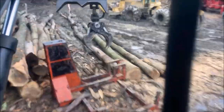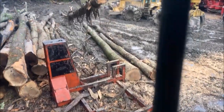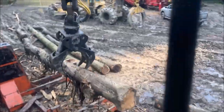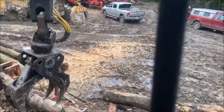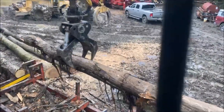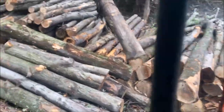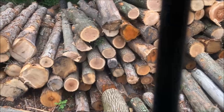So this here is aspen. If it's sound and big enough, it goes for blocking, for pallet grade, scrag wood. We'll stretch this out to 20 foot. If it's not sound, it'll go into the pulp pile. Makes great pulp. Makes a good scrag too. It's good and sound. That tree just died maybe last year. Knock some mud off of it. Put it on the pile.